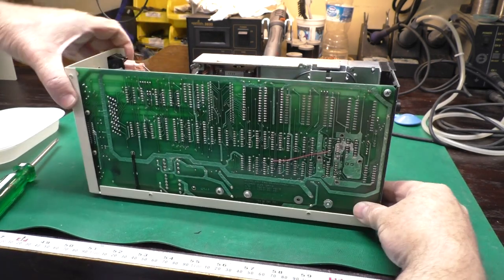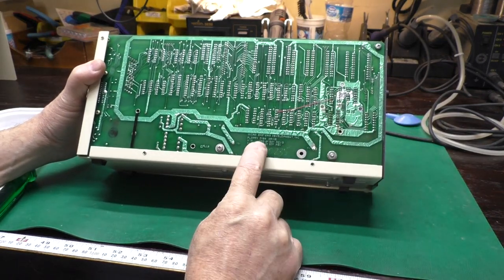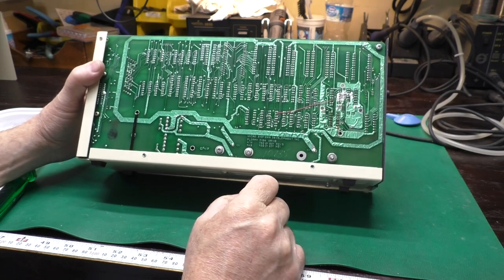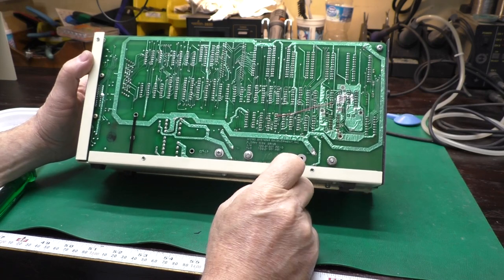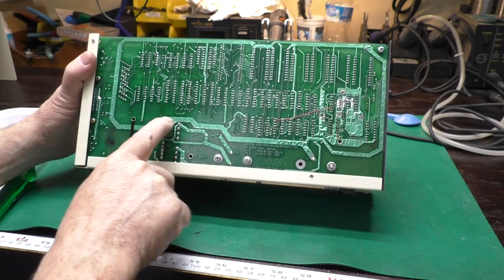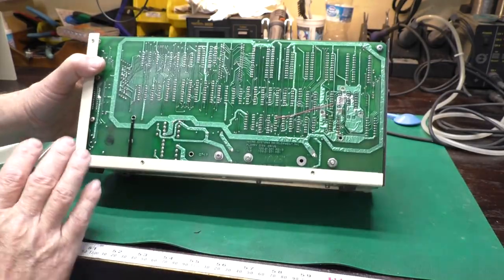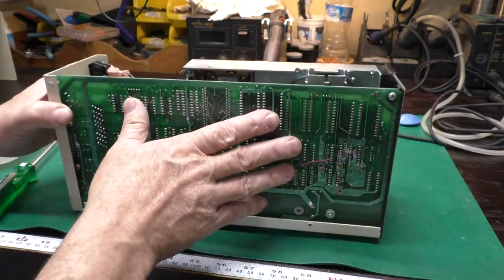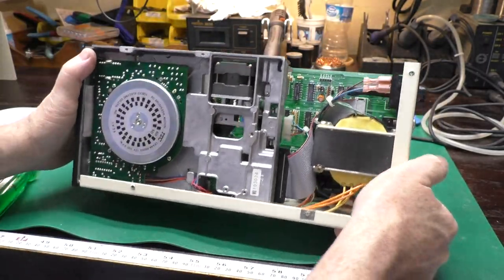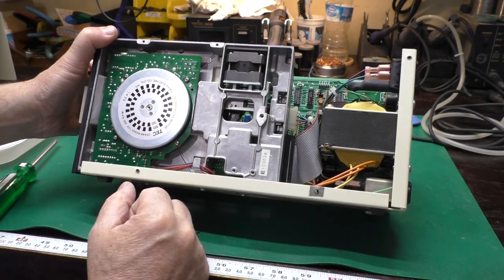Okay, what do we have inside? We have a Microsystems Development Inc. floppy disk drive. It has a number hand carved in here. One bodge wire, a zip tie. Nice, the classic 1980s crinkly surface to the board, because they ran it through a solder bath before they did the solder mask. On this side, we have our TEC floppy.